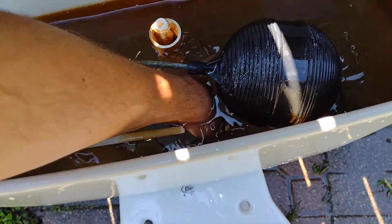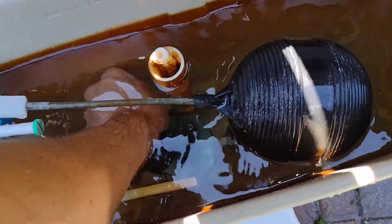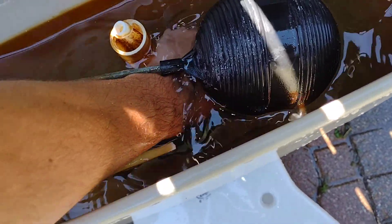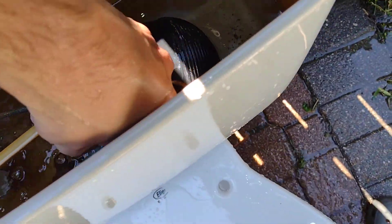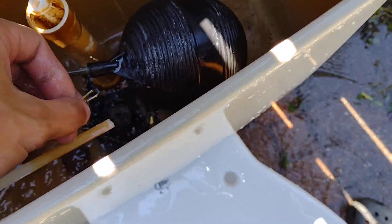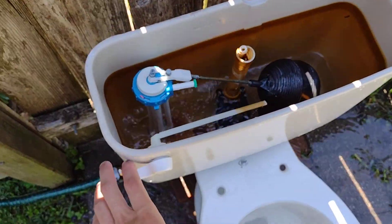Let me just change this real quick. Because I don't think it's fair to have a 1.6 gallon toilet using 1.28 gallons of water, because then it will leave stuff behind and clog easily. So, let's get this old one out and the other one in. There we go — I've just got to hook this up. Alright, the new flapper is in. Seems to be good.